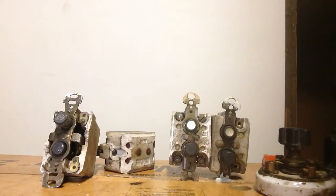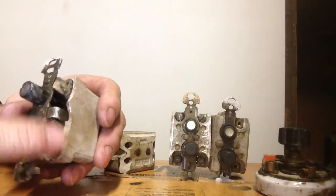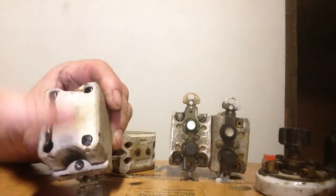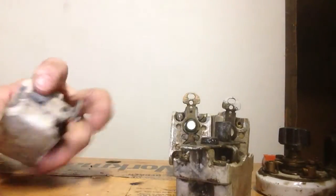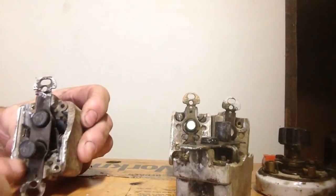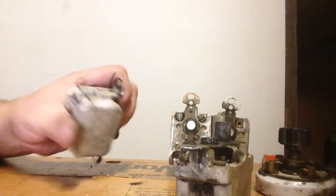I'm going to tell you again: the best way is to turn it around. Whichever one's connecting is your common. So one of these is your common — whichever one the wire is hooked to. These ones are your switch wires. You'll probably have a wire hooked here and a wire hooked here, and one on one of these two. Common wires on top — you'll have one hooked here, a switch here, and a switch here. Or you'll have a common here, a switch here, and a switch here. Either way, your common will be on top.